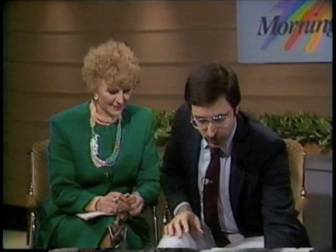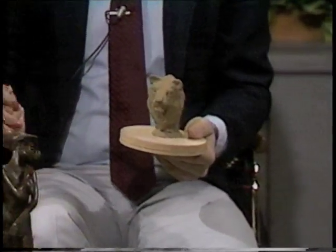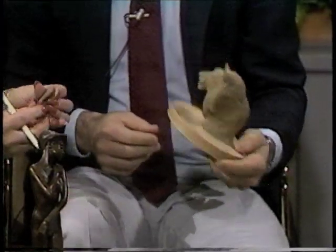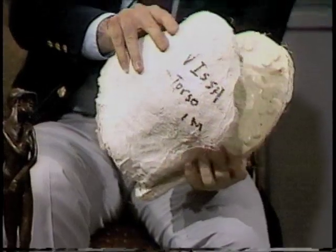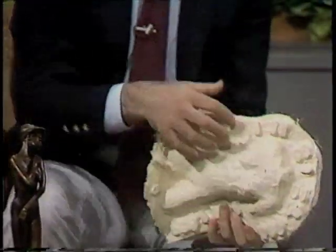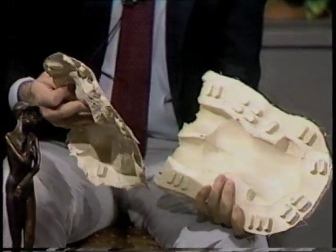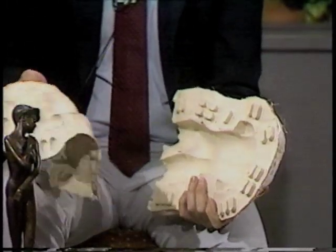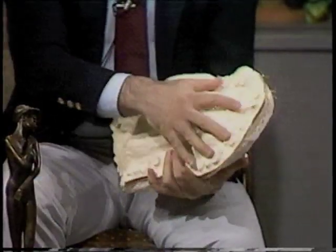This piece is made of wax-based clay — it's a beeswax. It's fairly stiff initially, but as you work it, it'll get softer. When the piece is completed, we proceed by making a mold of two materials. There's plaster on the outside, and the inside part, which is brushed onto the wax original, is a polyurethane elastomer — a liquid rubber — and it stiffens into a fairly nice consistency. That provides for any undercuts that can be removed easily, and then the mold itself will key back together.